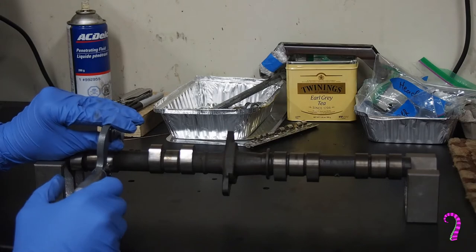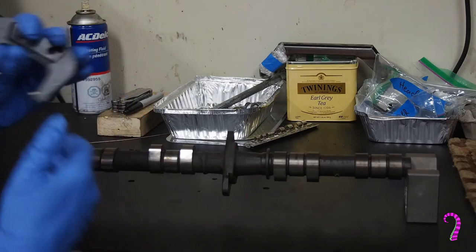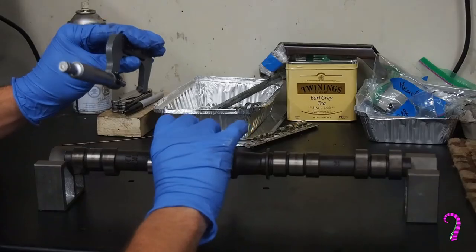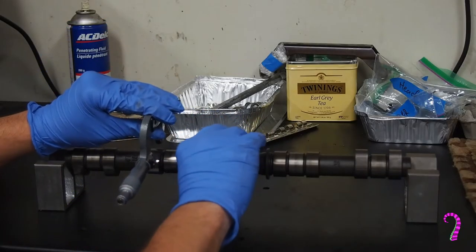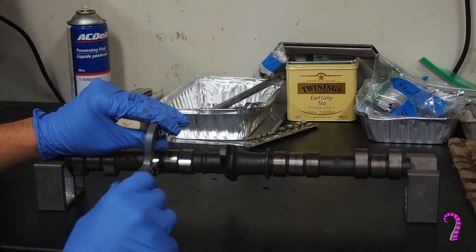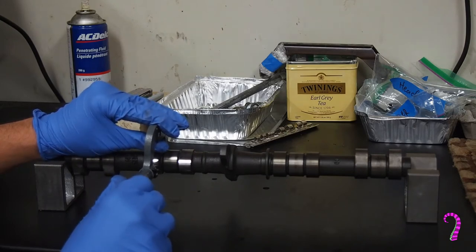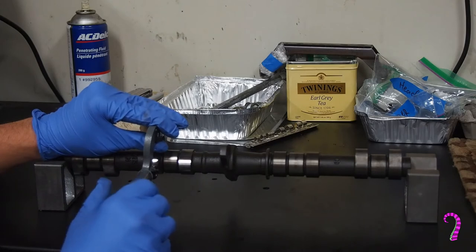For the intake, we'll be looking at 1.402 to 1.410 inches at manufacture, with a 1.4 inch service limit — i.e., if it's less than 1.4 inches, we need to replace the cam. I found these ones were all around 1.405, plus or minus about a thou, with none measuring anywhere close to a service limit. This makes sense given the good overall condition of the cam surfaces, but it left me scratching my head whether these had actually come off a bike with 60,000 kilometers on the clock, or if they'd been replaced at some point in the bike's life. It could also be that the lubrication system is just really good at preventing wear on these camshafts, which I'd believe.